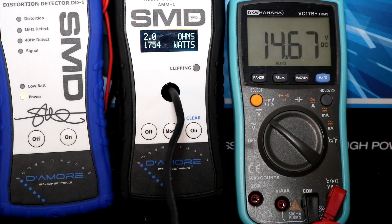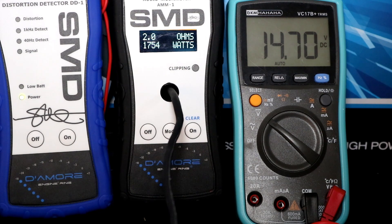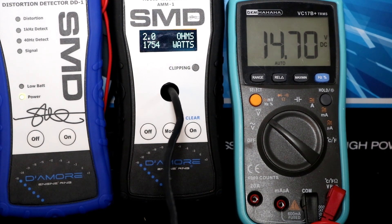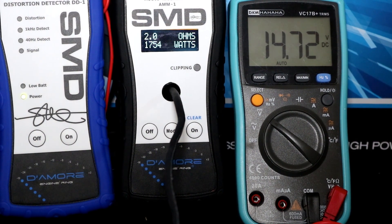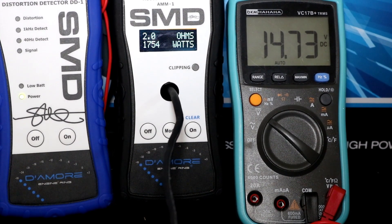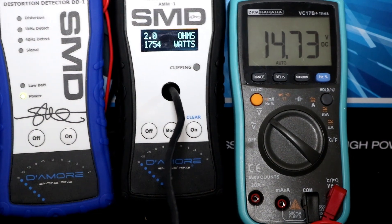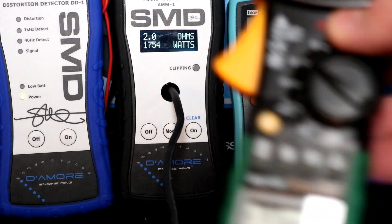The only way I think we're going to get more power out of the Rockville on the certified test is more capacitors inside the amp. Dynamically this is a really good amp - almost 2500 watts on dynamic power. If you're going to compete with this amp and run a really long sine wave, you're going to get about 1600 to 1700 watts certified. This is running with three XSD 1400 batteries - all brand new - and two RD Power 150-amp-apiece power supplies, so 300 amps total that kick in like an alternator.